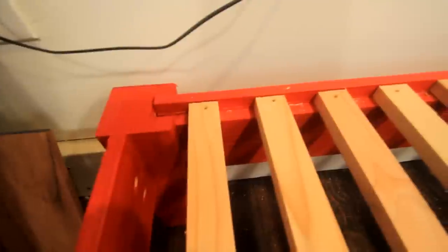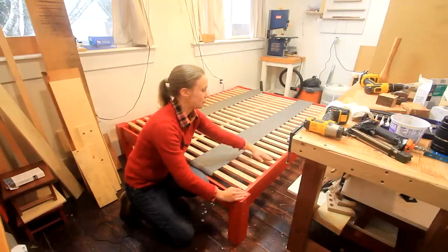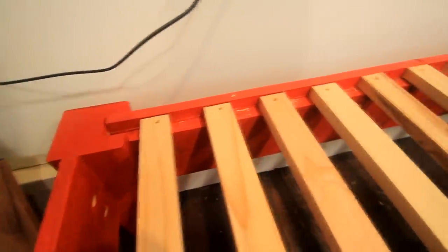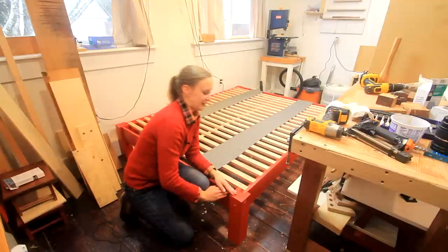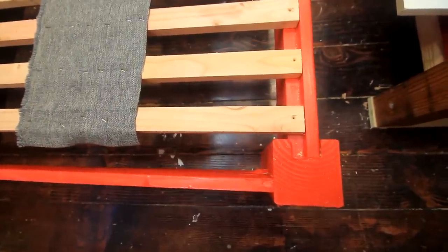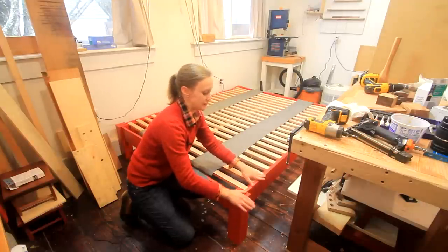In order to rest the slats on, I cut out a groove so that fits perfectly with these one-by-twos. I also made mortises in the posts where the two-by-six fits in, so it carries the weight that way — the weight is really distributed right there.